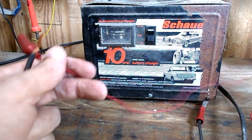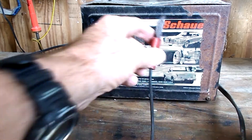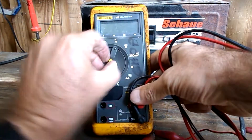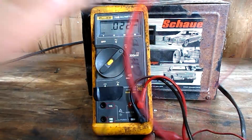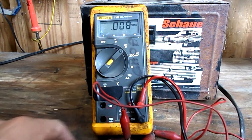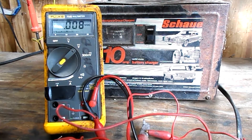So I need to do a volts check on the output of this charger. I'll hook up my clamps and hook these little clips up to my meter leads. I got my multimeter out. I'm going to DC volts. I'm going to hook my black meter lead to the negative post and my red meter lead to the positive post output of the battery charger.